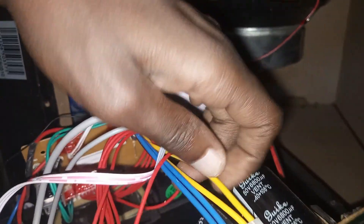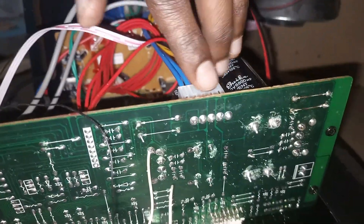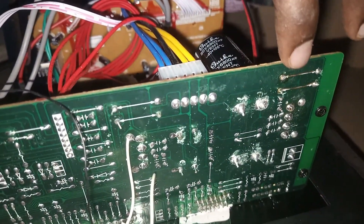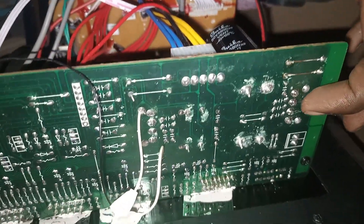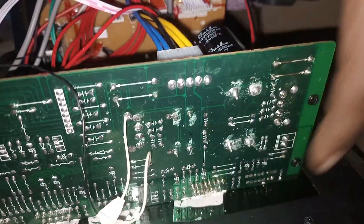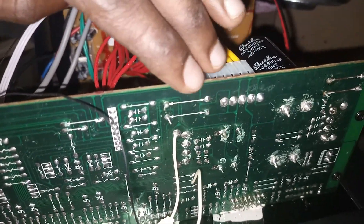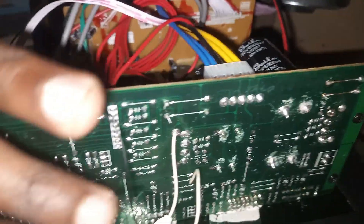So what happens: these 24V lines — the two yellows and one black — go all the way to the subwoofer through a fuse. And then the other 15V-0-15V lines go all the way to the other three — the 7265s.